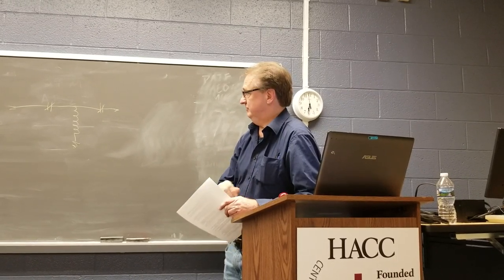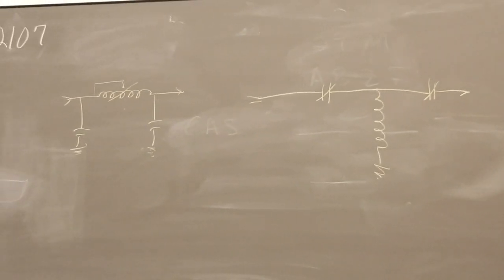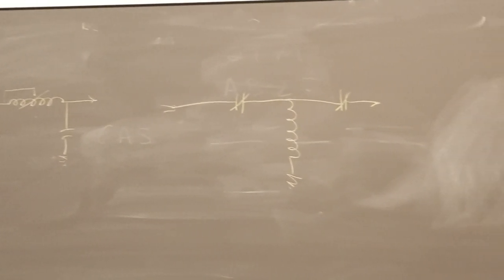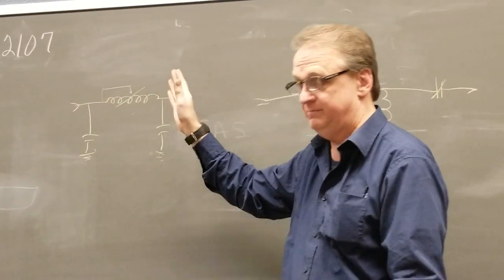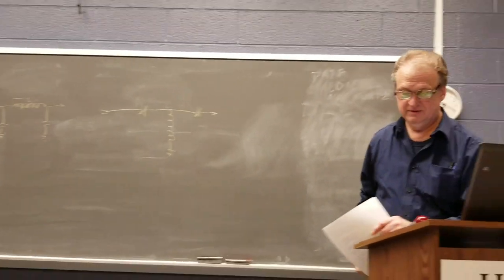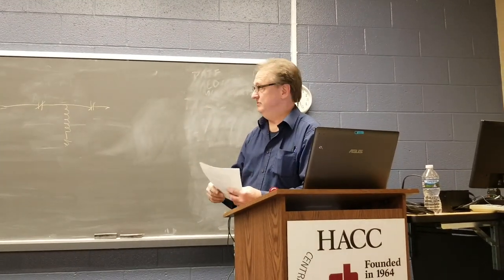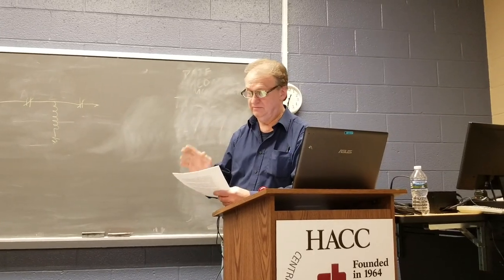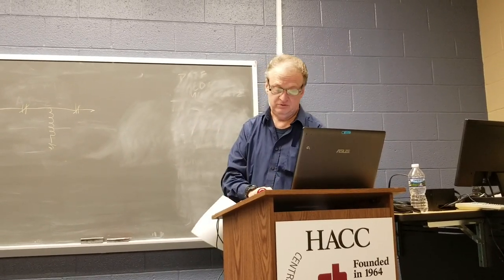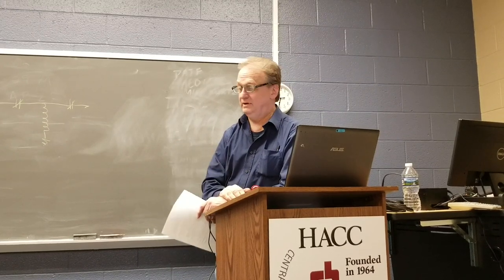Antenna tuners come in a couple different sizes and shapes. These are two of the most popular configurations. If you get an MFJ or whatever, any of them that you come up with, you have a way of tuning them. They can be variable tuning capacitors, or the coil itself could have different taps. What we used to do is take military surplus transmitters, which had roller inductors in them, take them apart and build our own tuners. That was easier because you could tune right in the middle of where the resonance is and get the most power out of your transmitter, which is the goal. If your transmitter is working into the impedance that the output of the transmitter has, you're going to have maximum power transfer. And in doing that, your signal goes a little better.